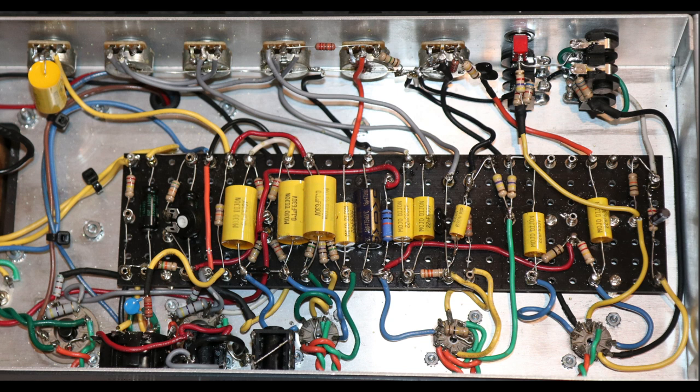There's no harm. But I'm looking for something that doesn't sag quite so much. So I've just linked this, right, with this orange wire here. This is the choke, comes through here to this turret, and then this turret is feeding the screen pins on each of these sockets. And bear in mind, of course, that this JTM45 kit from Mojotone is actually EL34 powered. So you could actually argue that you might want to have 1K screen resistors in here.